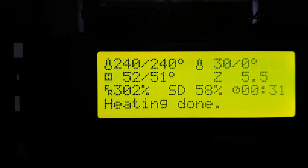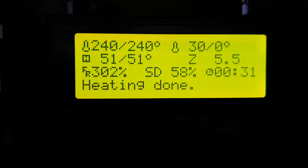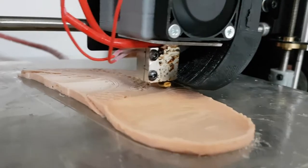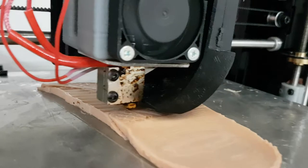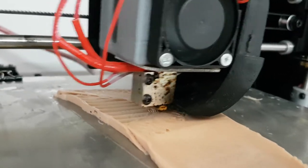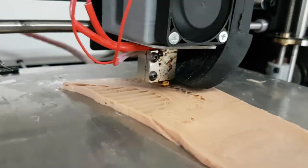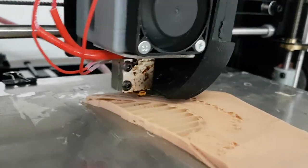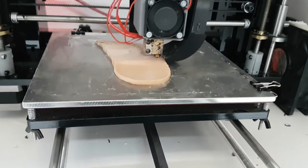Even with the very fast throughput of the Volcano, the 40-watt element is having no trouble maintaining temperature. I'm running the PLA very hot, but that's because I'm really belting the material through — it's a way of getting the stuff to go through quickly. The other part of the fast extrusion is that the Volcano tips have quite a long melt path, so they're very prone to oozing, which is the downside. But the plus side is you can really belt some material through, so if you've got volume of fairly robust and primitive parts you can really get the job done quickly.